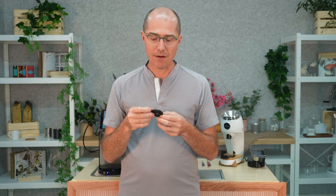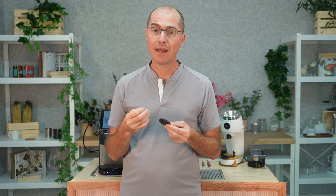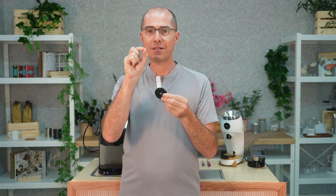There's also a problem where the screws that hold this part in place are made of stainless steel, and there's an interaction between the stainless steel and the brass which makes those screws extremely hard to remove if you don't take them out soon. Our screws in here have had a Phillips head, and some of you, in trying to get those screws out, have slightly damaged the head. That makes a little bit of stainless steel powder, which is free stainless steel that can then add to more interaction with the brass.